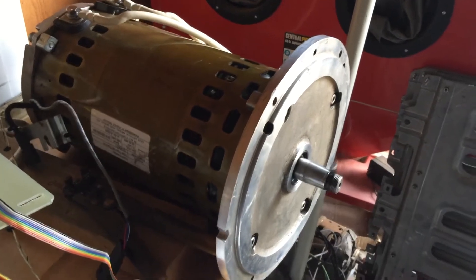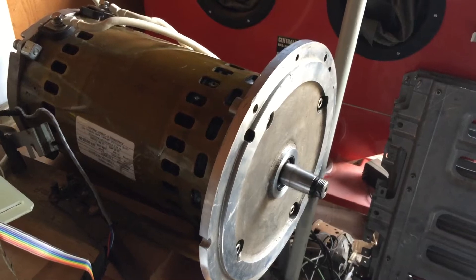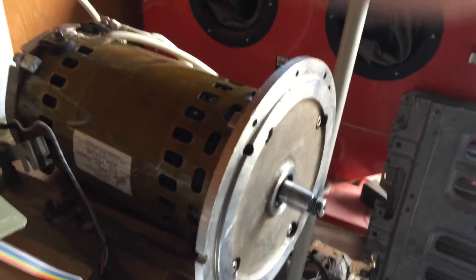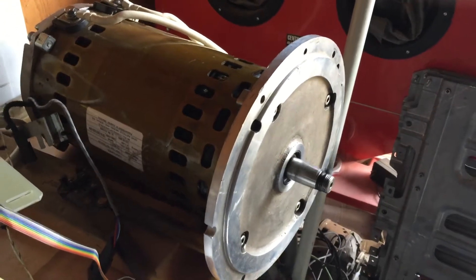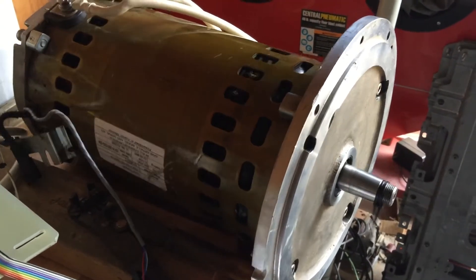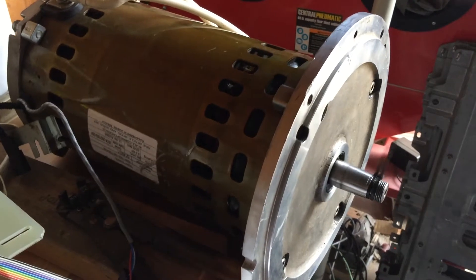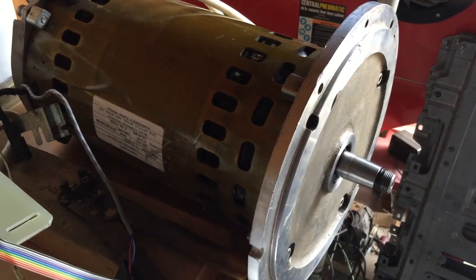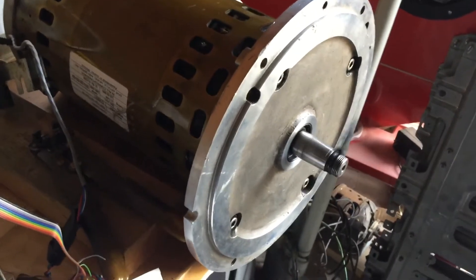This is what it's doing — got some motor movement finally, took a while. My throttle pot though is being weird; it only works in a very small range. It slows down and jumps around. A little bit more and then it just stops. It has a very small range that the throttle pot's working.